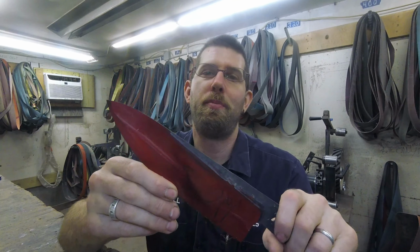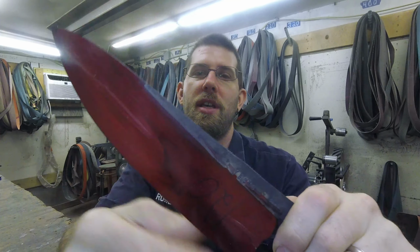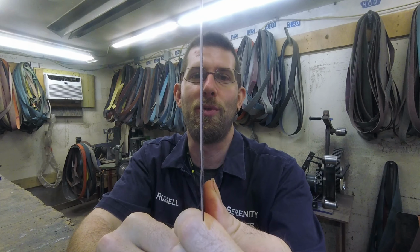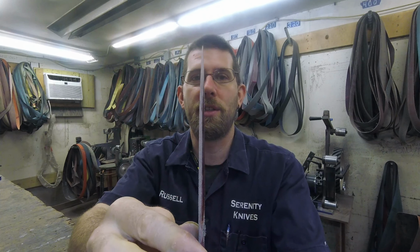Morning. It is Tuesday, April 21st. I will be jumping back onto grind lines on custom knives. So this is still at 80, and I've got the Dykem on it. Basically, I want to thin that down some more before I make it up to 120. And same thing for this guy. This is in the same spot.